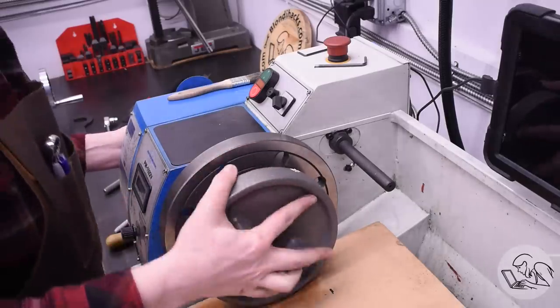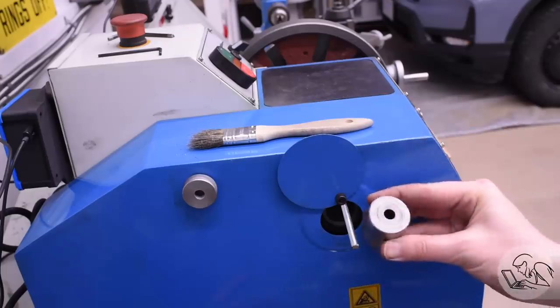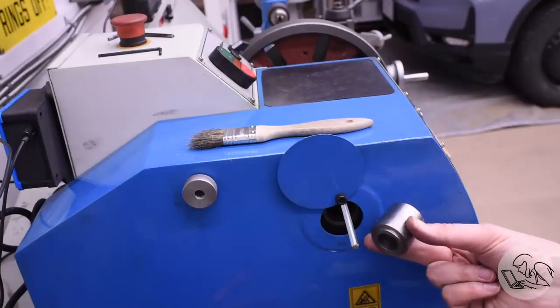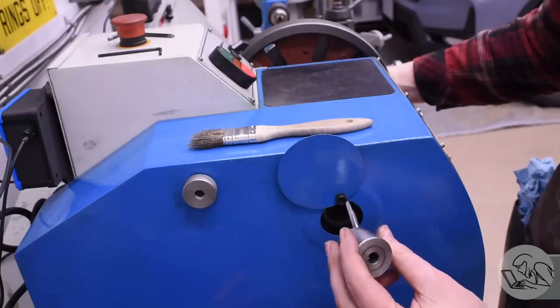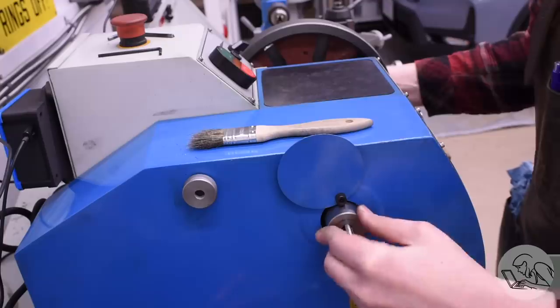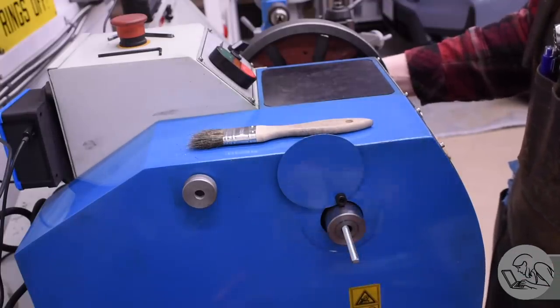This is what the build notes say to do and it works perfectly. The secret is this cap that I've turned previously — it's part of my homemade collet chuck setup, and it allows me to clamp the drawbar in my collet chuck up against the back of the spindle bore, which is behind the sheet metal there. It's the perfect solution here as well, just with the addition of a couple of washers since this threaded rod is smaller than the drawbar on my collet chuck.